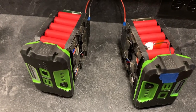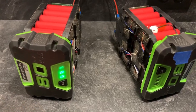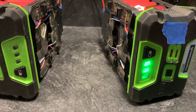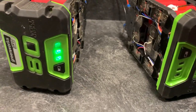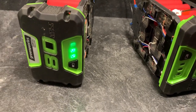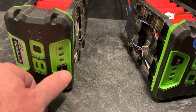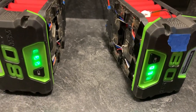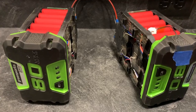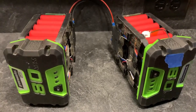These have been hooked up together for about less than five minutes, and honestly, if I didn't remember on my own, I wouldn't know which was the good and which was the bad, because now they both flash to two bars. Before, the bad battery wouldn't register anything when you pressed the check voltage button — no lights came on. After five minutes, I already have what I think are going to be two good batteries that the charger is going to recognize and bring to 80 volts. That 15 minutes doesn't even seem like it's going to be necessary.